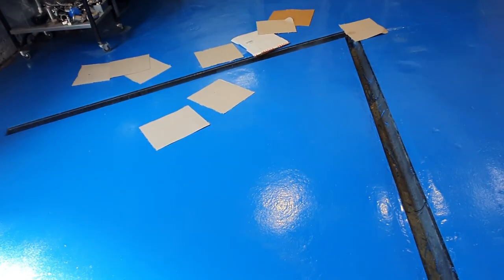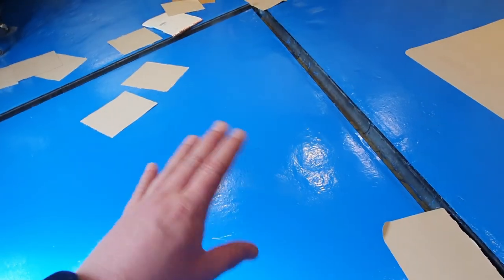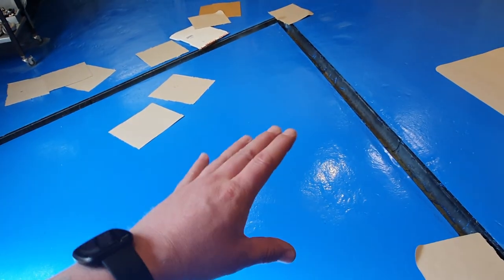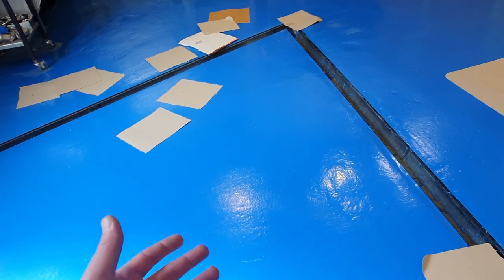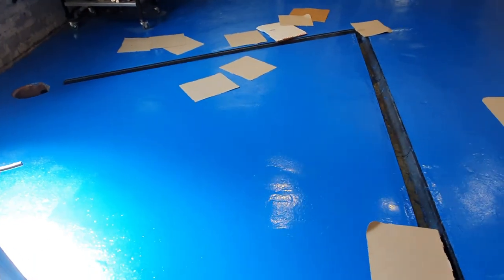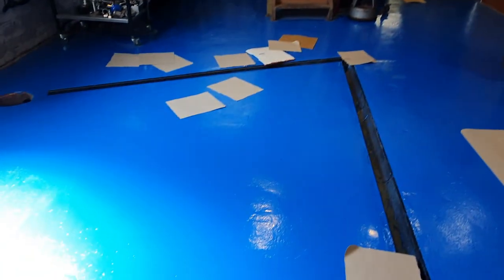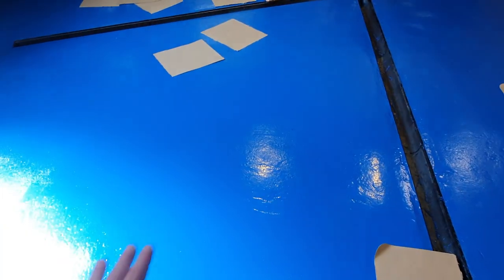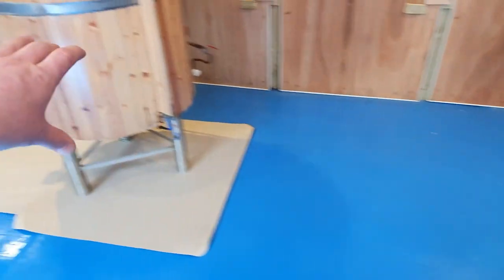mainly caustic and acid from the cleaning process, and heat from emptying the mash tun. We normally just let the mash tun drain and it runs down into this corner. Where the hot water comes out of the mash tun, on the resin coat, it marked the surface - decolourised it. It didn't flake or come up, it had just faded a little bit where the heat had interacted with the surface and the pigments. So this area, I'm going to put an extra thick and durable layer, another tin down here just for backup, and another tin along this edge.